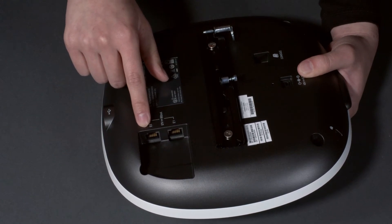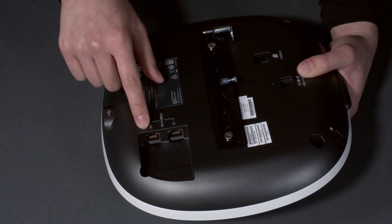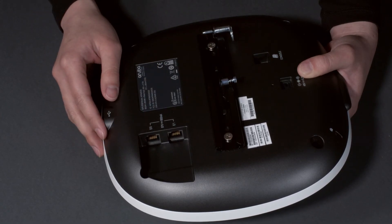Please note that the AP535 requires more than 30 watts of power to operate, so you will need an 802.3BT-capable switch, or alternatively use two PoE-plus ports. Both E0 and E1 ports are smart rate and PoE-capable.